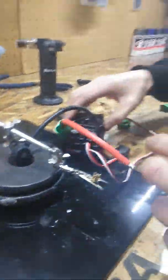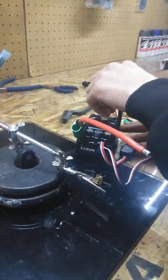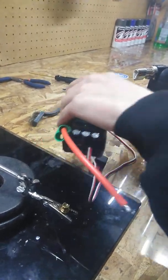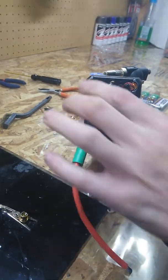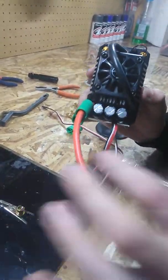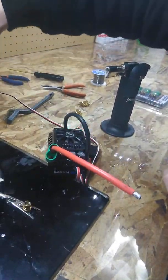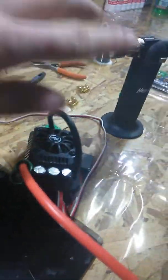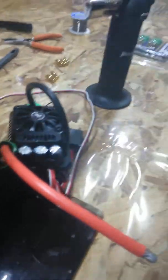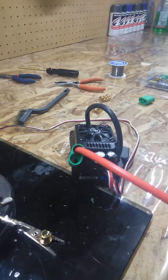What I'm doing right now is getting ready to heat up and take this wire and fold it back into one of the connectors. It may not stay in there very well, but you just push it in. You can use tape to keep the other wires out of the way so you just have this one wire to work with. Make sure you keep an eye on all these connectors — don't actually solder the spare wire in there, that's just to keep it out of the way.